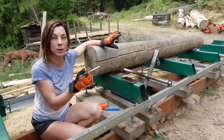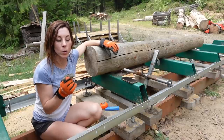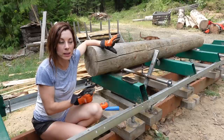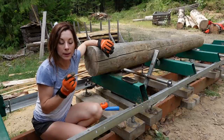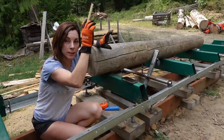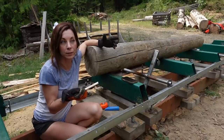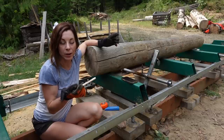Whether I say this now or later, I'm not sure, but regardless of the problems that I'm having with the bird's mouths, one thing that I noticed when I was out there and thought about was that for each gable end, those two rafters that close in the cabin, I want them to be more or less the same dimension as the rest of the timber frame, because I'm not closing the walls in from the inside. I am going to put a couple of little windows up at the front in the gable end. The back window is already framed in with the timbers, and in order for it to really look good and feel like a proper timber frame, I want to mill up some rafters that are like timbers.